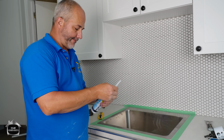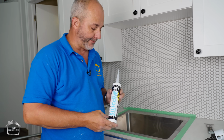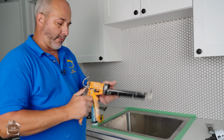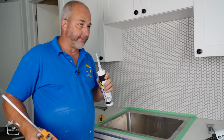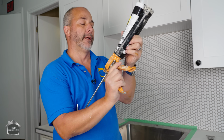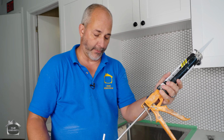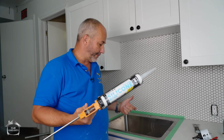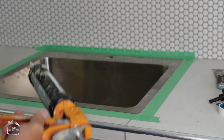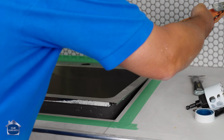Just for the record, no, this is not a sponsored video, but this is my favorite silicone of all time. It's made in Guelph, Ontario. Cheers to Canada. One thing you might want to know. If it doesn't smell like vinegar, it's not really good silicone, okay? There's a lot of crap being sold on the shelf for $9 a tube that ain't worth $2.50, okay? Good stuff stinks. That's how you know the difference. All right, so what I'm gonna do is just prop it up and seal it from here.